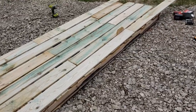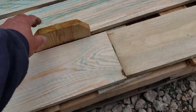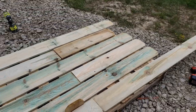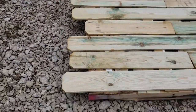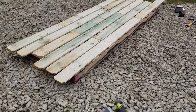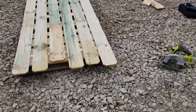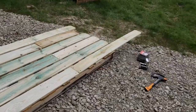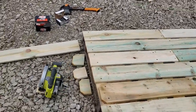What we did is we spaced them out a little bit so the rain can kind of fall through. We tried to use one of the boards to actually space it. Next, we're going to screw them all in, and then I'm going to go right on the outside edge and cut it with a skill saw. That's what it looks like with being all screwed together — we really just kind of went right at it. All I'm going to do now is just eyeball it and cut a straight line on both sides. I went ahead and cut them — real easy, just eyeballed them.